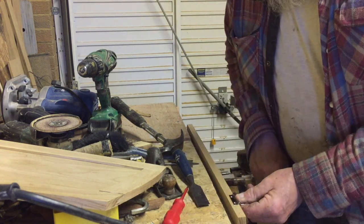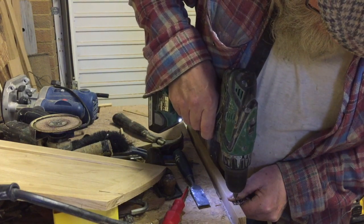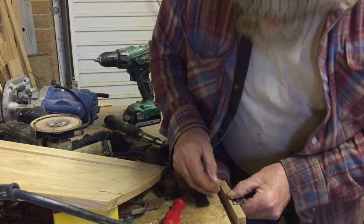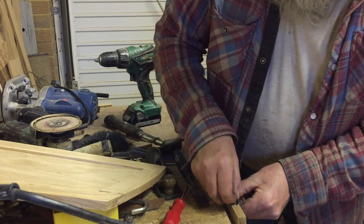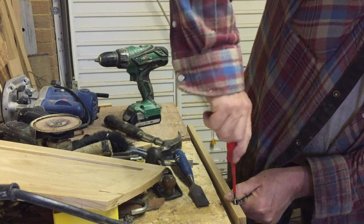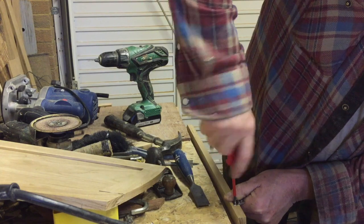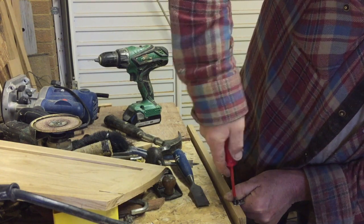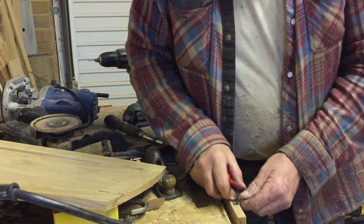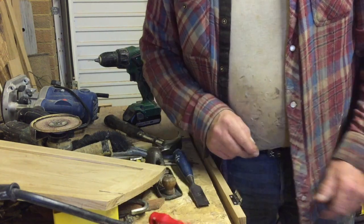That one's done. What I do is drill a pilot hole — going into oak with these little screws, they're a bit soft so you need to be careful. I'm using them now because I've got to hang all these doors, make sure they all fit, put the catches on and check everything fits. Then I'll strip it all down ready for oiling up. By doing it that way around — although it's a lot of work — you get a much neater job because you don't get oil all over the hinges.